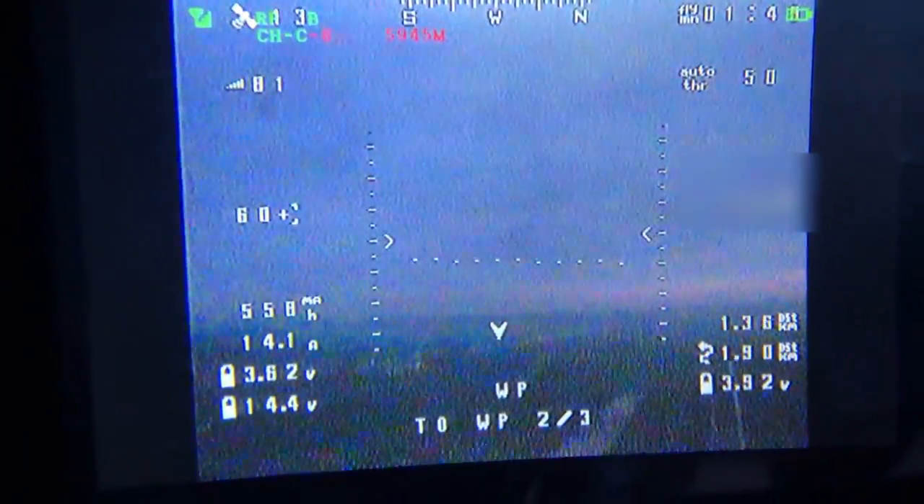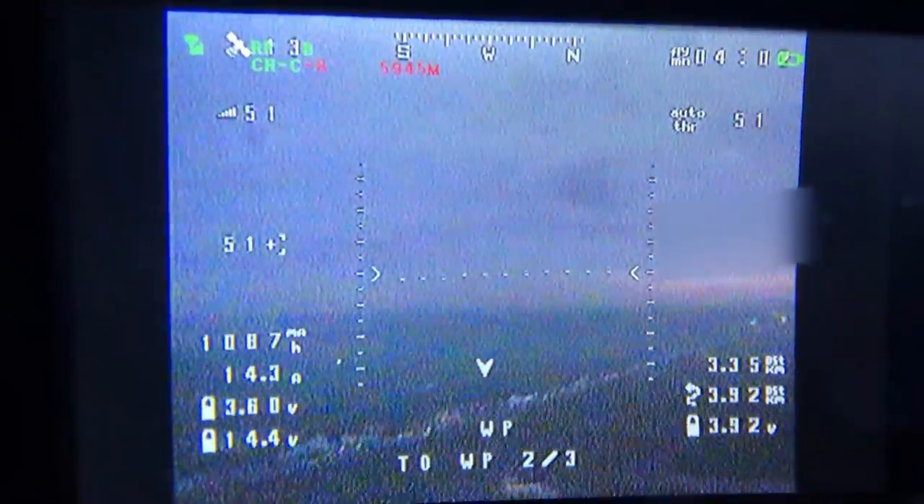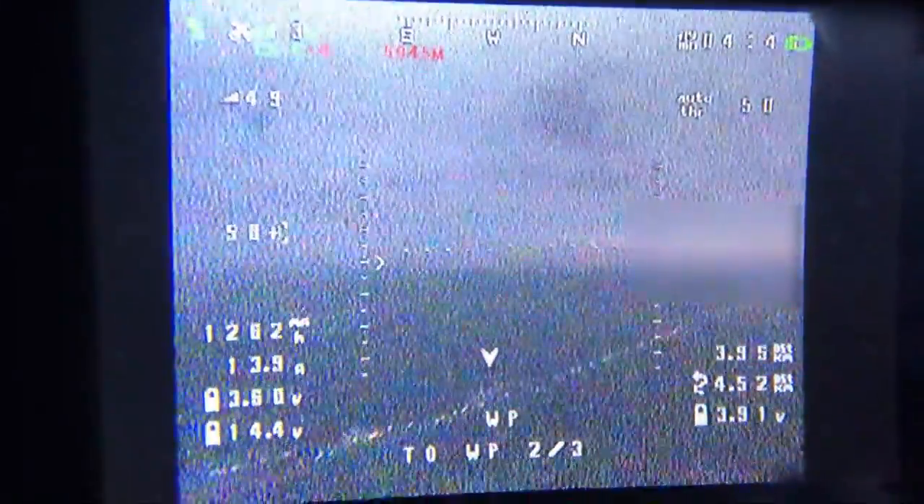The triple feed patch is doing well — good video at 1.3 kilometers so far, and at 200 milliwatts of power. At 3.35 kilometers the video is still great and RSSI is still there, which is surprising because the transmitter is on the ground. I've never gotten this far with the X8R receiver, and the RSSI is in the 50s — quite impressive. It's almost at 4 kilometers out before heading back.